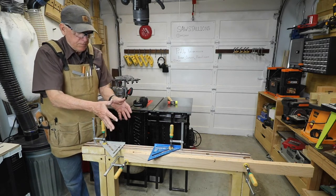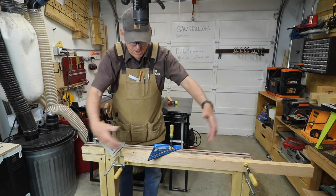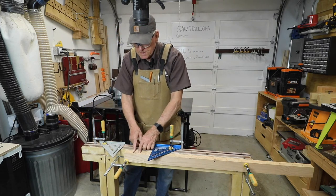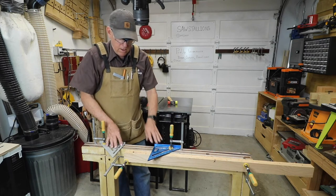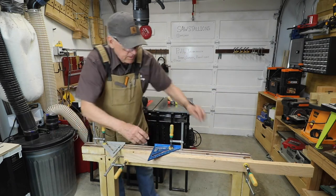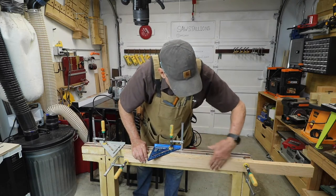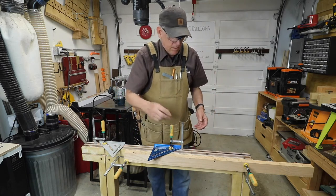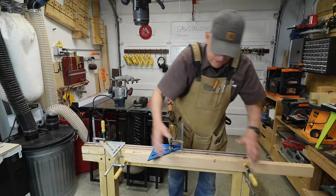So I have that work piece and I do that mortise. If I have an identical work piece, I would just take it out, put in the identical work piece — everything stays the same — and line the mortise in the new work piece up with this line here, then cut it. I want to keep my reference face for my edge guide the same, so I've got the little carrot here marking that. This face is 90 degrees to the reference face, so I don't want to rotate the piece around, because then my edge guide would be on a different face.